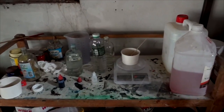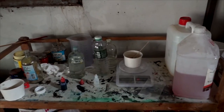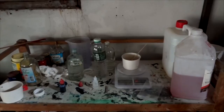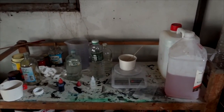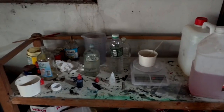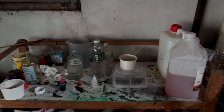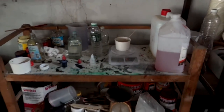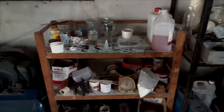That's what boat building and fiberglass work is all about — getting it right. A lot of people just dump it in and nine times out of ten it works fine, but if you're working on a big expensive boat and you're off on your percentages, you might be in trouble. If you're in the west, read the chart on the bottle. If you're in the east, Central and South America, or places like Spain and Portugal, learn how to formulate your resins using monostyrene, cobalt or another accelerant, and MEKP. That's it for this video — if you have questions, ask in the comments below. Have a good day and don't forget to have fun.